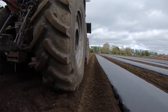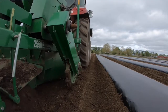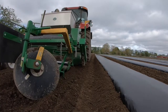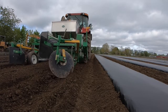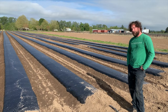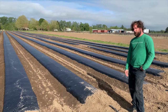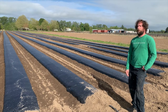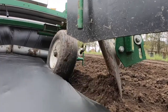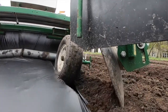It's really difficult to keep your rows straight, but you can do a couple of practice rows with no plastic and no drip tape for your first round, which I highly recommend if you've never used a plastic mulch layer. And then you can mark it as well. Another thing that's really important as you lay the plastic is making sure you get enough soil on the edges of the plastic — very, very important. If you've got a windstorm that comes through, it will rip all your plastic up and you'll have to redo everything. So make sure your discs are set up correctly and you're piling up enough soil on the edges so it does not blow away.